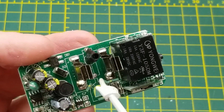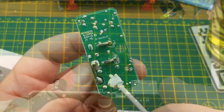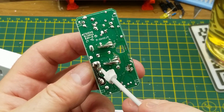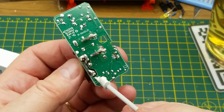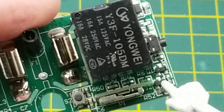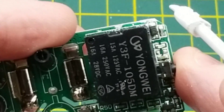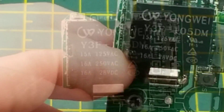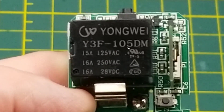We have actually a little anti-tracking slots there and there — that's kind of cool. Fuse there. No components on the back of the board. There are the two anti-tracking slots from the other side, and another big one over here in between the contacts of the relay — I guess that makes sense. Down at this end, we have a couple of transistors, a diode, that LED, the push button to locally control it, and the relay, which claims to be able to handle 15 amps at 125 volts — which is in fact the rating written on the outside of the device.